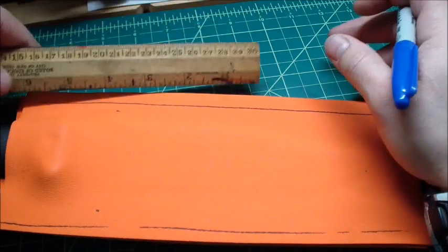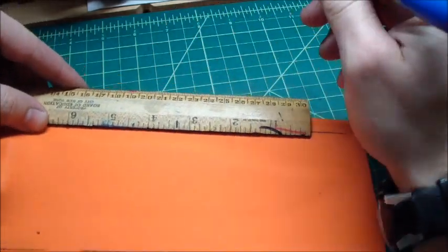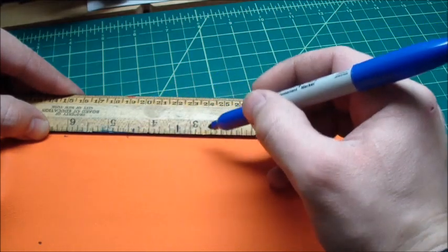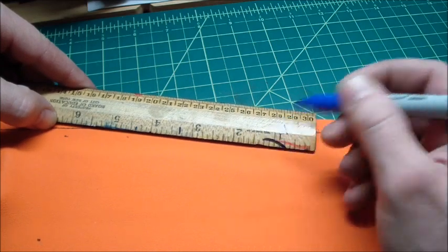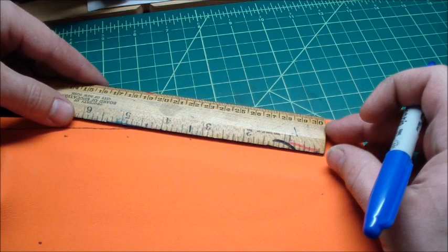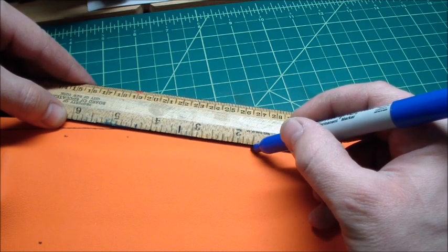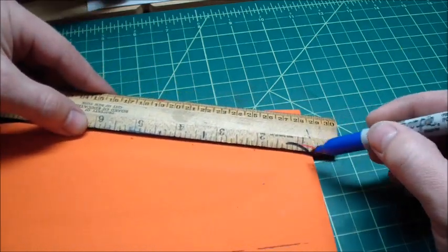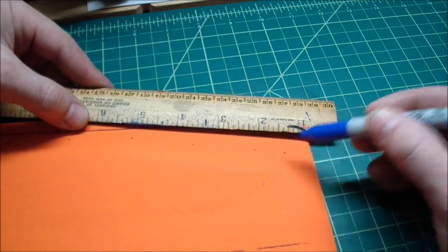with the ruler. I use 1.5 inches. That's the most universal distance between the rivets. And again, let me do this not through the viewfinder. I'll make my drop. Me personally, I like the natural curves. I don't like going straight, so I will actually copy the drop point with the rivets. And now you see on the end, I actually won't make the full 1.5 inch, so I will make it 3/4, which is half of it, which is also the dimension of the Tek-Lok.